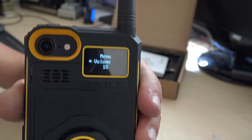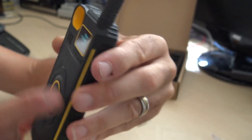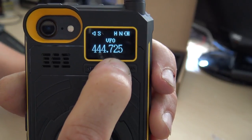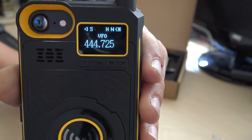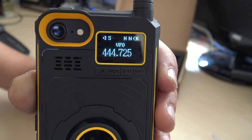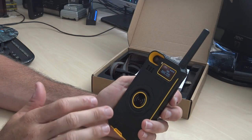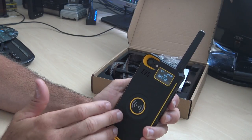Not a lot of options for changing things. I went to VFO mode and manually stepped down from 479.9 MHz using 100 kHz steps to get to my target frequency. It would be a lot easier to program via computer software, and I'm awaiting more information on that. Keep in mind this device will do frequencies above and below ham bands.